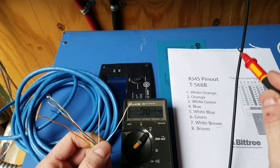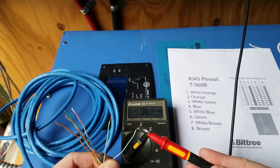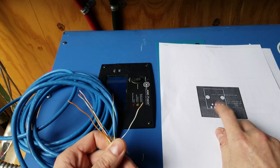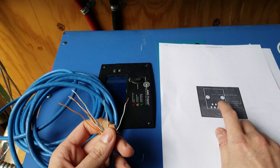I've got the negative lead going to the circuit breaker on the negative side and touching the blue stripe wire I have 53.4 volts. With that reading I know pin number 5 is actually pin number 5 as indicated on the pin out diagram, so I should be able to connect these two wires and see this inverter turn on.